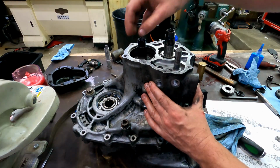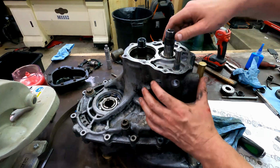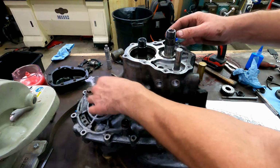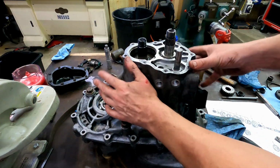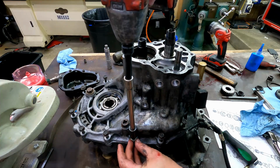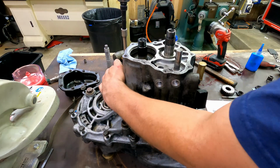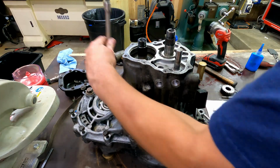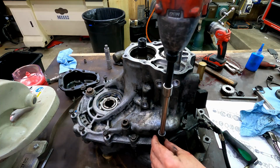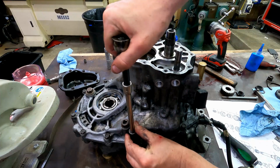Take the bearings, don't have the bearings in there when you're going back together with the case halves. Then jiggle up and down on the shafts and on the shift rails and tap around that differential case bearing, and everything should just ease together. Now I'm just going to tighten these real easy, in a crisscross pattern. Now I go back around with my hands and just make sure those are snug.